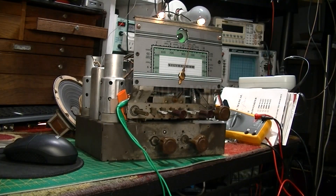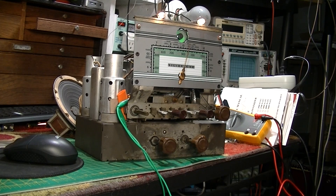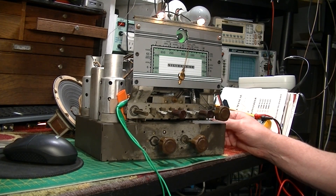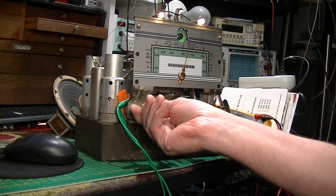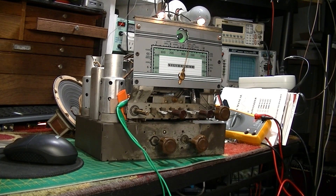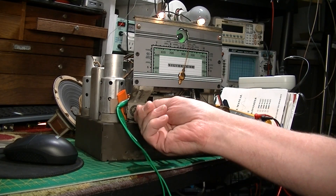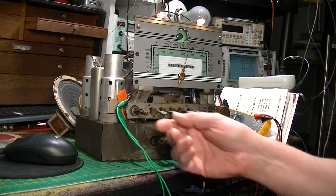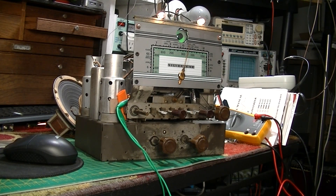The problem I'm having - I started this about six months ago and put it on the back burner because I wanted to work on a Grundig and had other projects, house repairs, things coming up. I'm excited to go back with it. The reason I shelved it is because my transmitter is transmitting at 1100 kilocycles, but the dial is reading at position 10 instead of 11. I did an alignment on it - it went real easy - but my amplitude was way down, maybe 50 millivolts.